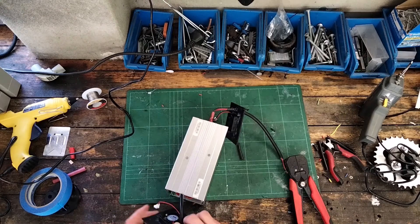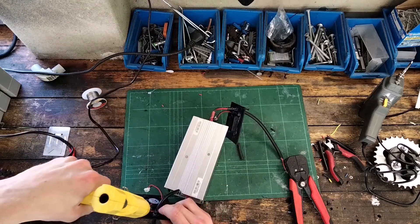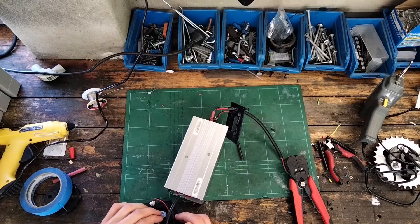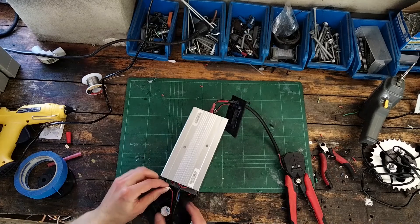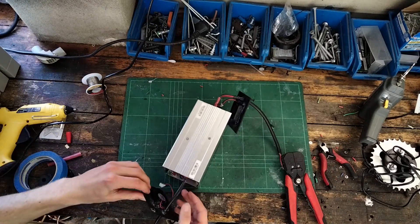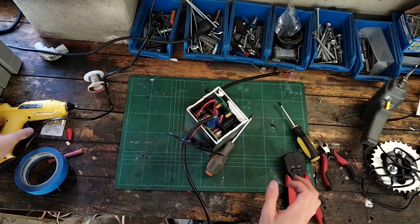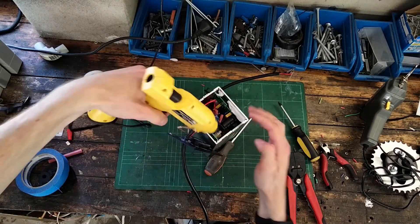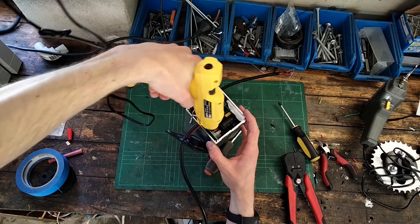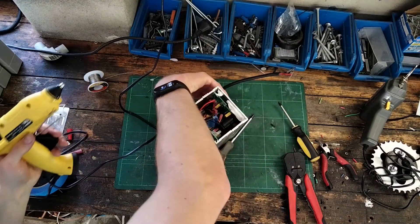The fan wires are very fragile, so you may want to add a dab of hot glue onto the fan wires to stop them from ever coming off the fan and being damaged. The hot glue is pretty much set — I'm going to plug in the fans and screw it all together. Before I close it up, I'll also dab hot glue on the LEDs so they never wobble around and cause havoc inside the charger. Do that for both sides.